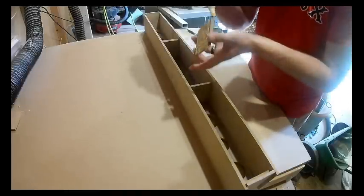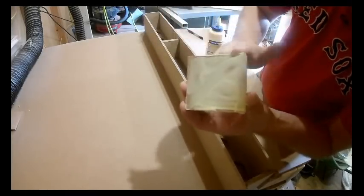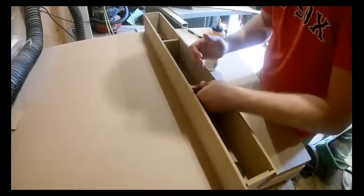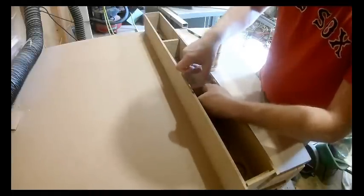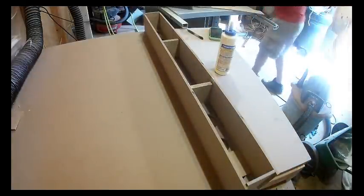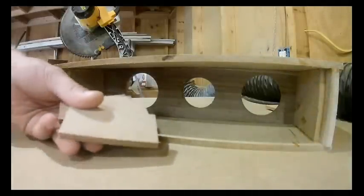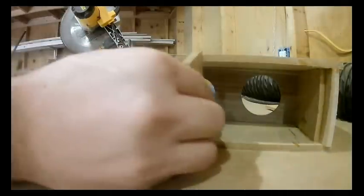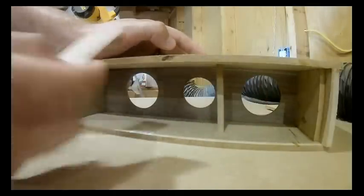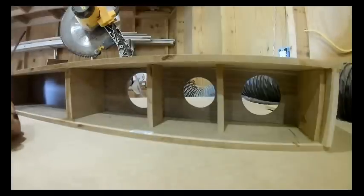This should be a quarter inch from the edge of the box so the rear baffle can fit in. Glue one right next to it — this one is going to be a half inch from the rear of the box, because the rear baffle of each speaker enclosure will be a half inch thick. Glue a piece that perfectly matches the inside of that compartment. Also glue some smaller pieces in the center, making sure they don't block any screw holes and that you have plenty of room to navigate speaker wire. This helps with flexing of the box.